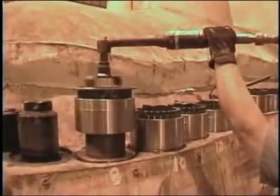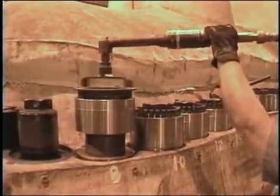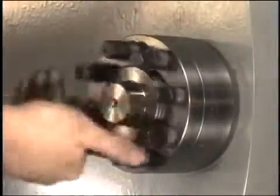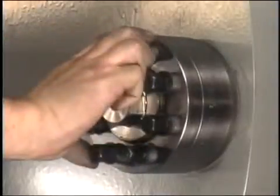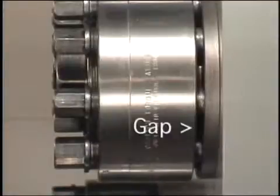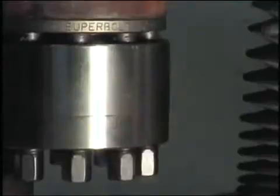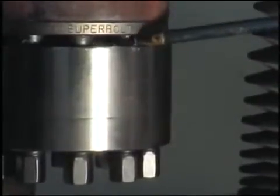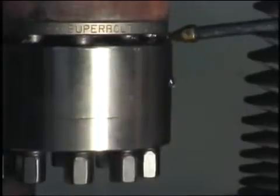For larger sizes, a nut runner may save time and effort for spinning the tensioners on and off the studs. After seating the tensioners, you may want to back it off slightly as demonstrated here. Anywhere from a 1/16 to 1/8 inch gap usually works well. The additional gap between the washer and nut body allows for easier oil application and improved penetration, especially for inverted applications.